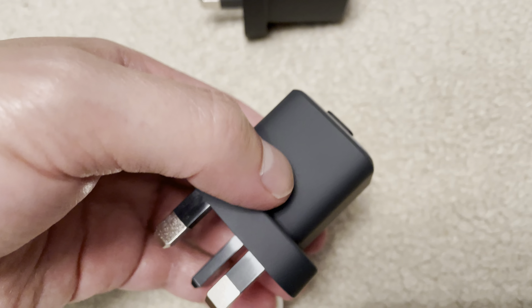Just as a comparison, let's look at a non-GaN power adapter — this is a 45 watt USB-C power adapter rated at 20 volts, 2.25 amps, so 20 times 2.25 gives us 45 watts. Comparing the two, you can already see how much smaller and more compact the GaN power adapters are compared to silicon. And this non-GaN one is already a very compact model — one of the most compact on the market. This here is the standard adapter Lenovo ships with their ThinkPad, also 45 watts, but look at how much larger it is in comparison.